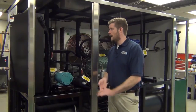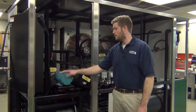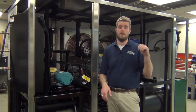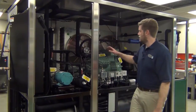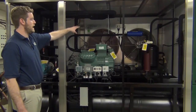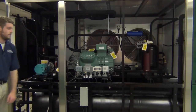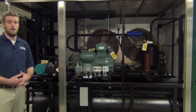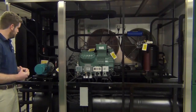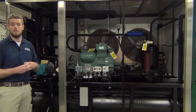The basic chiller components inside the cabinet are the electrical box and all of your plumbing connections on this side of the chiller. You have your recirculating pump and UV sterilizer — sometimes the UV sterilizer may be located in the purifier cabinet on the other side of the chiller. Further down, you have your compressor, the receiver, your condenser and fans. And then down here you have your storage-type evaporators and storage tanks. These are stainless steel tanks and coils wrapped with insulation and then sheet metal to hold that insulation in place. This particular unit has two tanks for a total of 450 gallons of stored water.